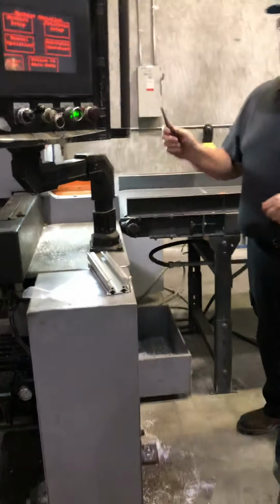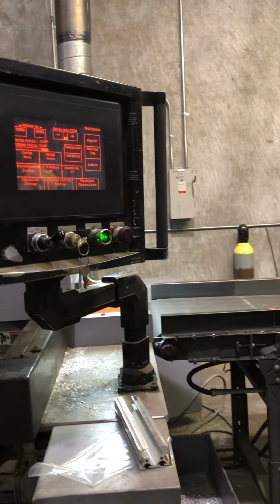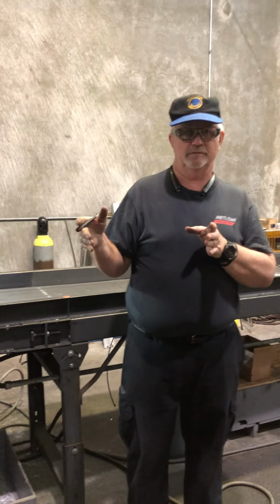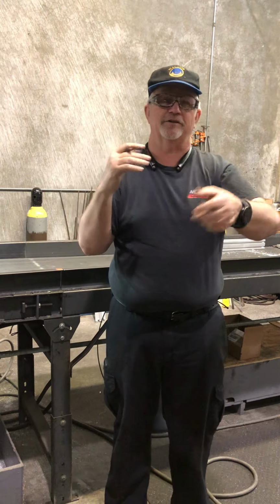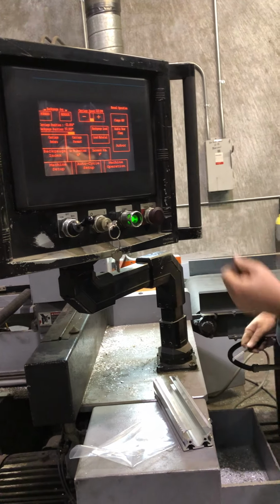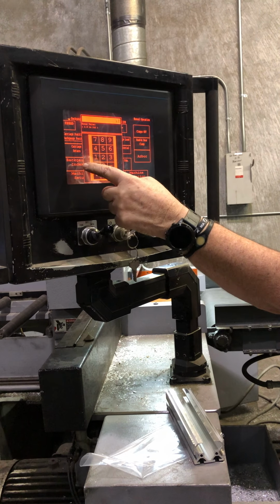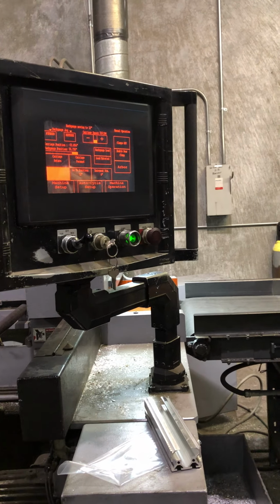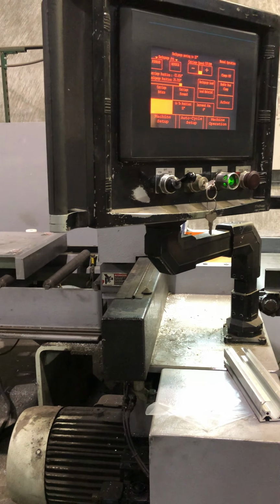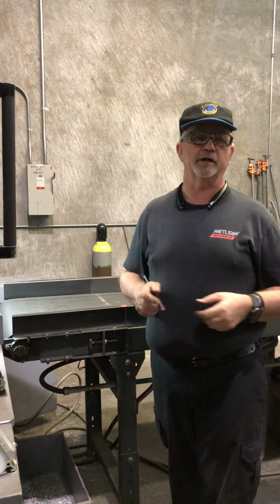All right. So the go-to position is behind the blade. If everything's equal and everything's right, the most accurate way to make a cut is an increment cut, because everything's done within the machine saying I have to do this, I have to do that. For the go-to position, say you have two pieces, you need 12 inches, and you have two little pieces that are a little over. Tell it to go to 12. You're just going to make a single cut, or maybe two cuts, because you have two pieces. Put it up against it, and make your cut, and that should be 12 inches.